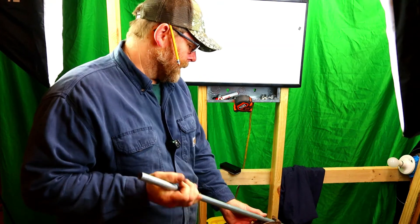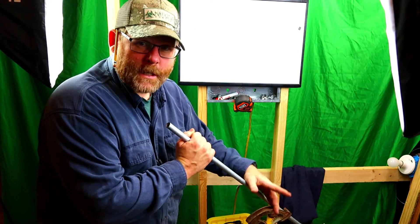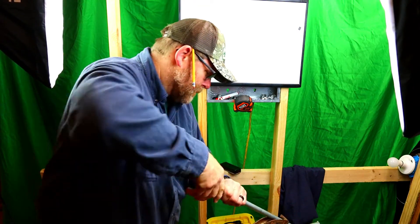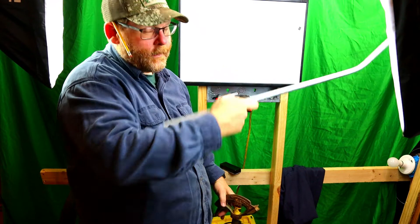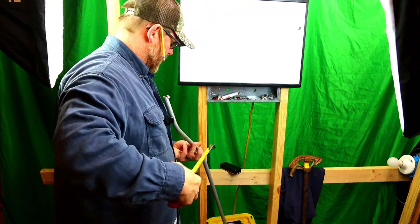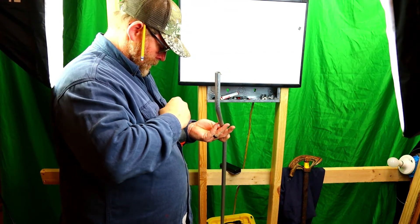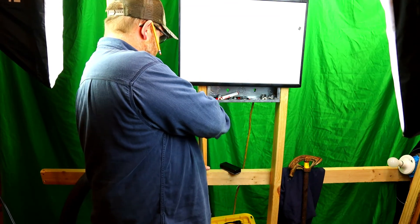Let's do it at 30 degrees. If you don't know how to bend an offset, check up here in the corner because I do have a video on how to bend conduit. Let's bend it — 30 degrees. That's pretty close. That looks like a four-inch offset, but we definitely need to check it, because that will determine if we lose that inch or not.